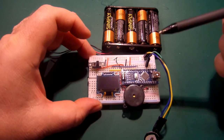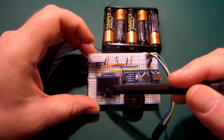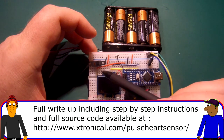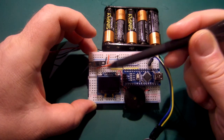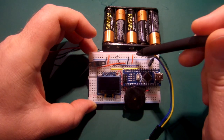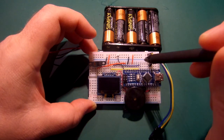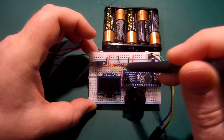Let's go through the actual connections first. The OLED — I've connected many of these little 128x64 screens on many of my projects. Basically you've got a ground and a supply, which are the first two pins. Ground's the first pin, supply is the next pin, taken off the normal rail. I've taken the five volts from the Arduino up to the five volt supply rail, and the ground up to the ground rail. Then you've got an SDA and an SCK connection. The SDA is the blue wire going to A4, and the clock SCK goes to A5.